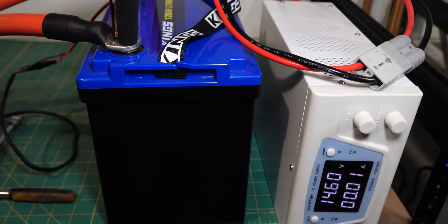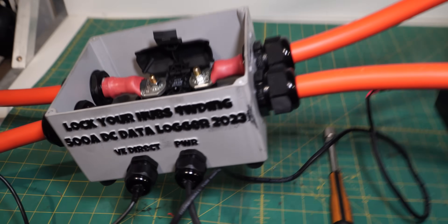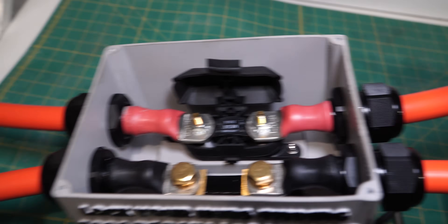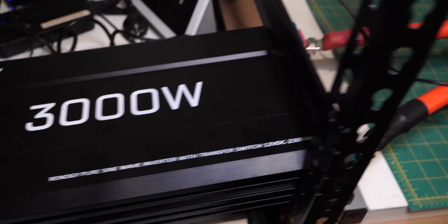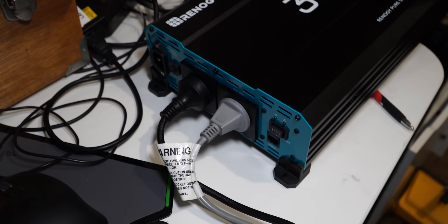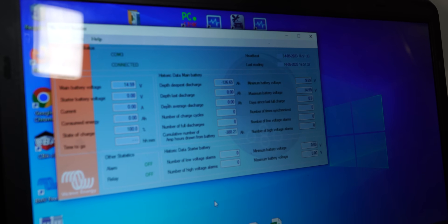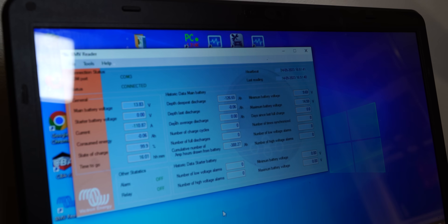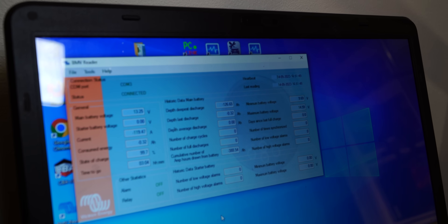Let's check out the results. I'll quickly run you through the setup. We've got the power supply charging to 14.6 volts — it's fully charged — so I'll turn that off and disconnect the negative. This is my testing cell. I've got a Victron shunt here and a positive mega 300 amp fuse. That cable there is 120 millimeters to handle the load. We're moving on to the Renogy 3000-watt inverter, running a couple of lights and a hairdryer off that one. We're sitting at about 14.6 volts, so I'll turn it on and see how many amps we'll be drawing. There we go — we're at about 120 amps, as you can see on the screen. We'll see how long it lasts.